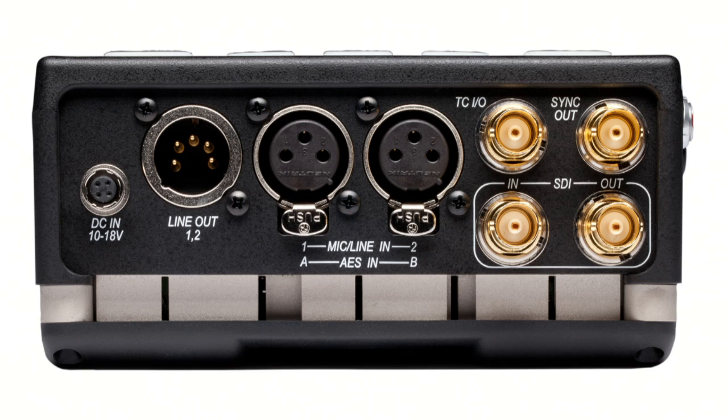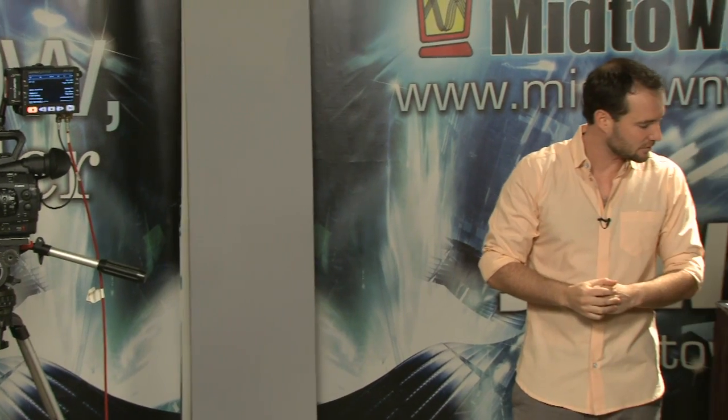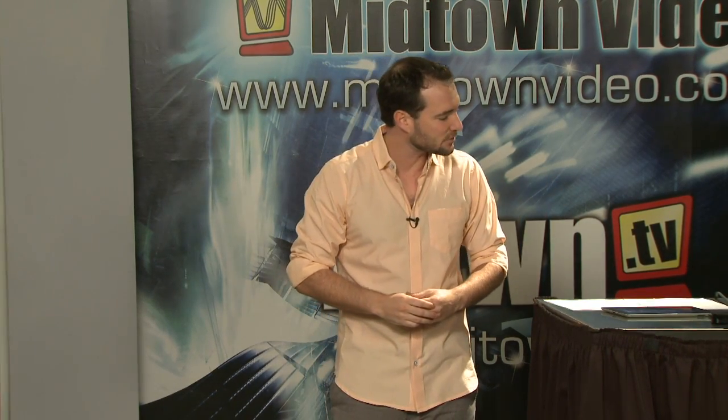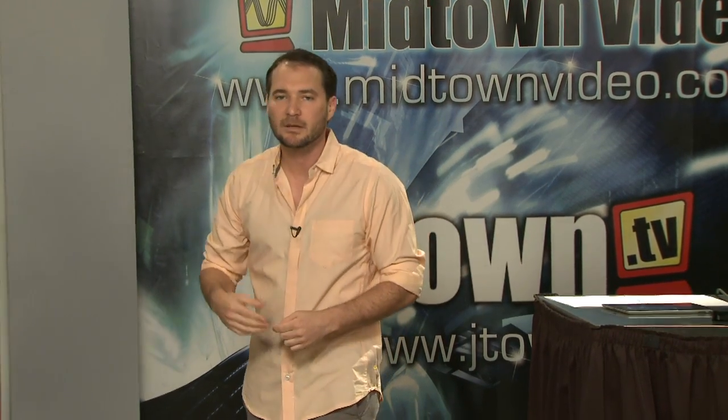You've got a 5-pin line out, so you're going to need a 5-pin to dual XLR 3-pin adapter if you want to take meaningful audio out of it live. Or, if you're coming out HD-SDI, you've got your audio embedded — embedded on the input, embedded on the output. Because it's Sound Devices, you know the audio quality recorded is absolutely flawless. We're at 48 kilohertz, low noise. Mic, line, and mic plus phantom power are available as options. It also has a built-in limiter and built-in high-pass filter, optional — you turn them on and off in the menu system.